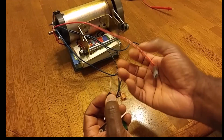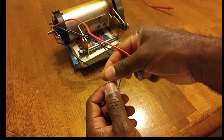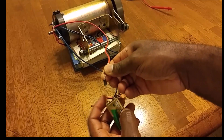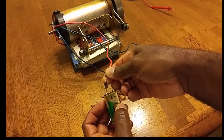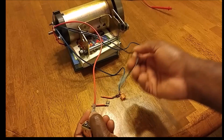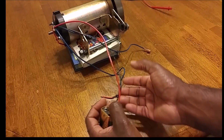The gray stripe needs to point towards the battery, just like that. Connect the diode just like that, with the gray stripe pointing towards the positive terminal of your battery, and then the black wire goes to the negative terminal. I hope that helps — it's that simple.